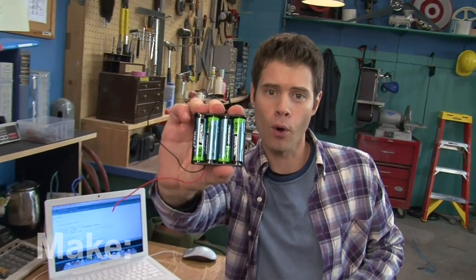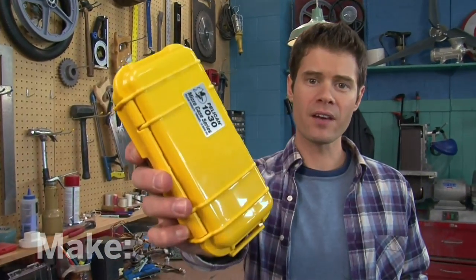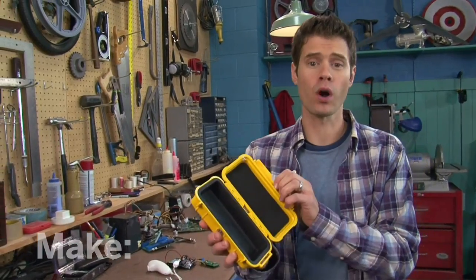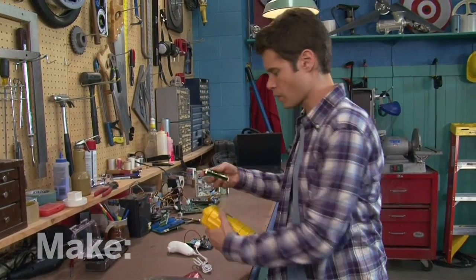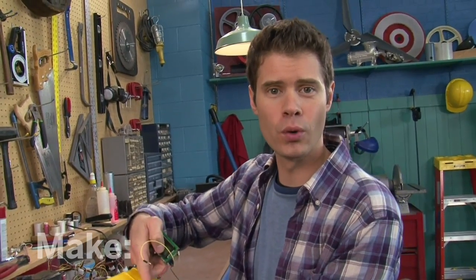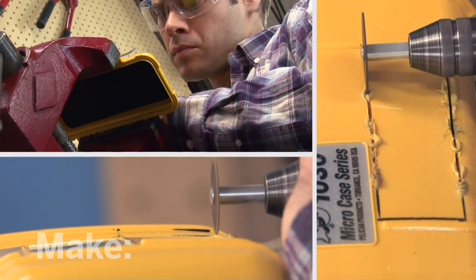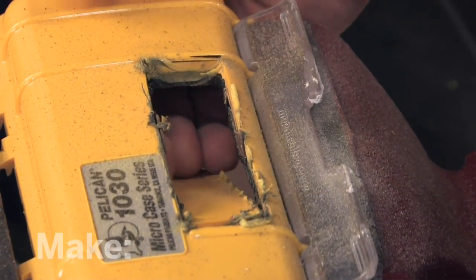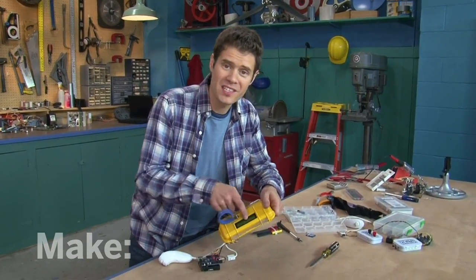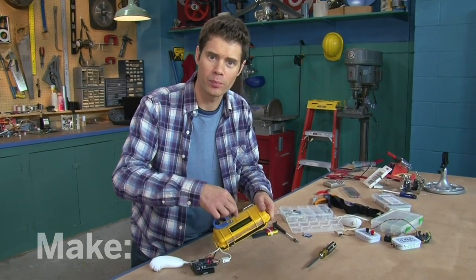This all runs off of four AA batteries once I've taken it off the laptop, and now I need a case to put it in. I'll need my flight recorder to be able to take some abuse, so I'm going to put it all inside of a rugged case. I got one of these online for less than $20 — it's hard plastic and it's waterproof. The first thing I'll do is cut a little window out of the front so that I can see my LCD screen when I mount it from the inside, and the best way to do that is with a rotary cutting tool. I've mounted my LCD on the inside of that window I cut. If you were going to take this somewhere like white water rafting, you'd probably put a little piece of plexiglass and glue it in place so that it's still waterproof.